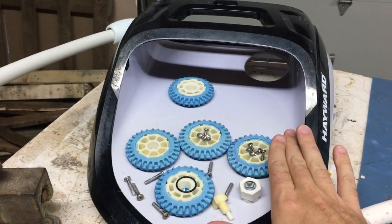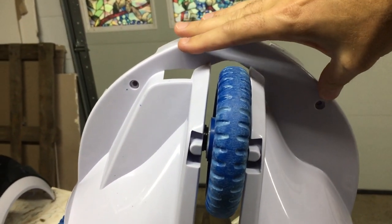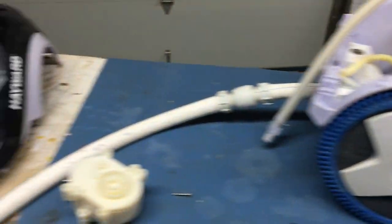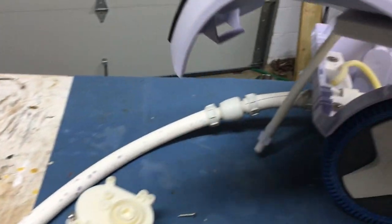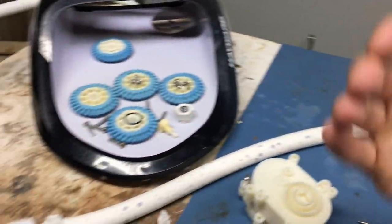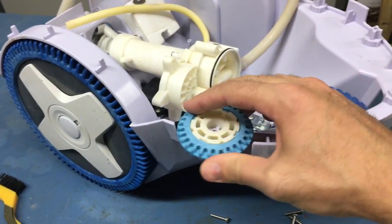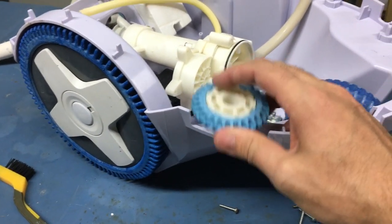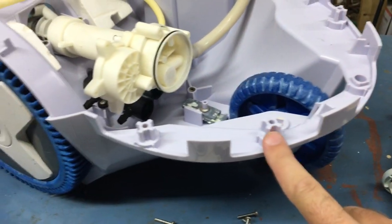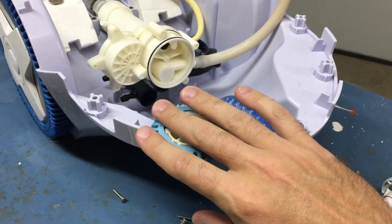Normally this top cap is resting on top of the unit. Underneath there are two screws or bolts that allow this to hinge. On the back you can see tabs that go into these hinge points on the lid so the lid can lift up and out of the way. When you do that, these roller wheels that are on the edge as bumpers will likely just fall away — there's nothing retaining them in place other than the bolt under here that kept the lid on and pinched them into place.